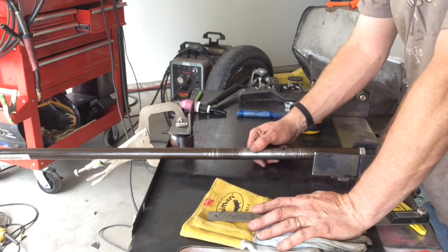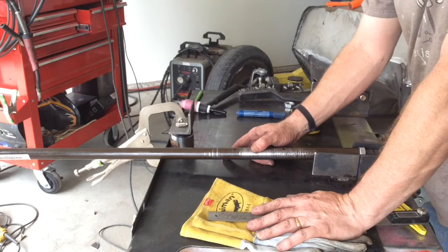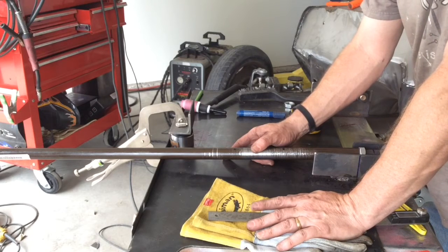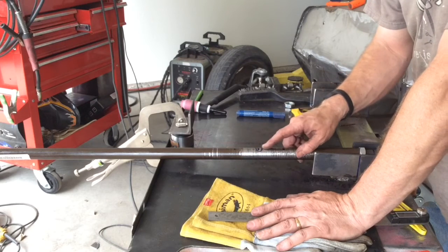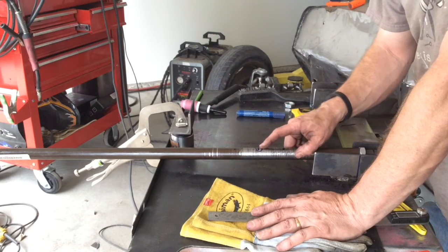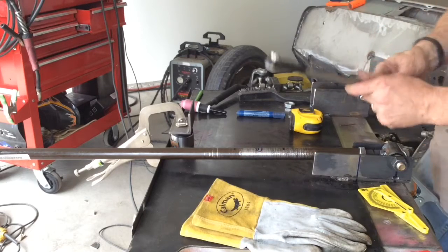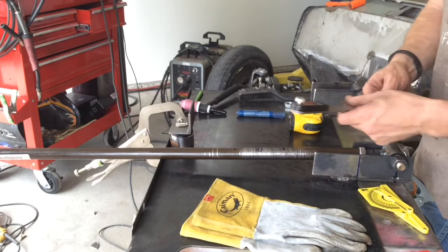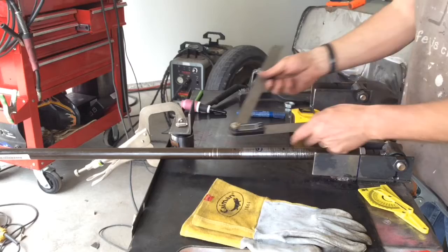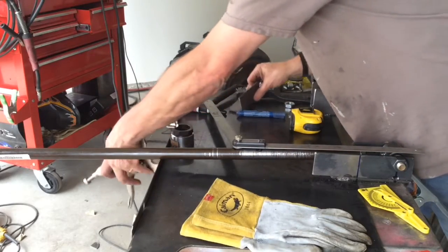Okay, so I'm going to be using a coilover airbag type deal. There's a couple different brands out there, but the most common would be what Ride-Tech makes. I think I'm going to use the 10-inch point to start my bend. Let me turn this on and zero it out. This has got an angle finder in it.